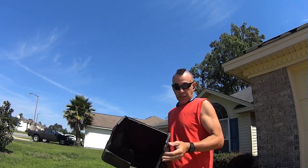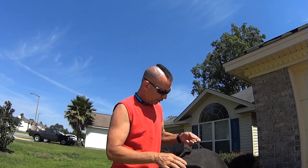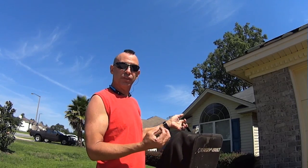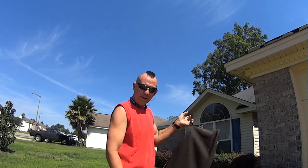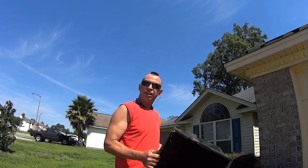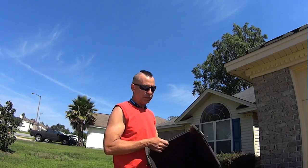If your bagger is not working really good, take it, hold it, and with good water pressure and soap, even soap, so it acts as a surfactant and loosens the dirt, blow it from the outside to blow it out with water, okay? Get it all nice, let it dry, and then use it next weekend. It'll be like a new machine. It'll work with much better results, okay? So if you can't see through it, air can't go through it, and if air can't go through it, grass ain't gonna pass into it.